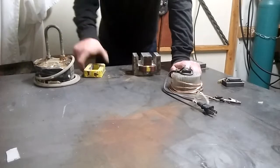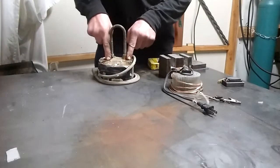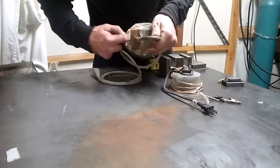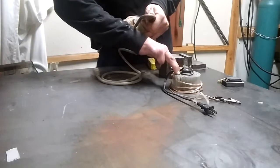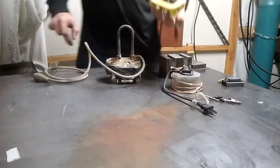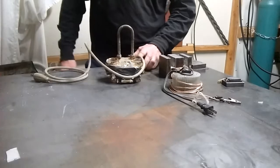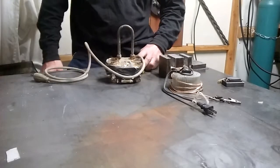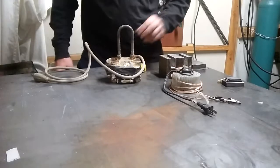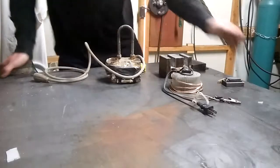What I've actually done with this one right here — this is what I made years ago, this is a microwave oven transformer. Right here on the side you see that little heat sink I got mounted to it — that's a rectifier. This was a little different: I didn't just reinstall the secondary, it has two secondaries in it. The reason I did this is so that way it can run all day long and not get hot. If you do just one coil, one of the high voltage windings, it'll work, but you have to duty cycle it.